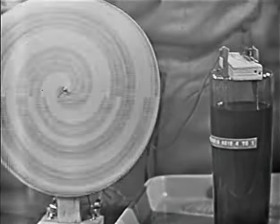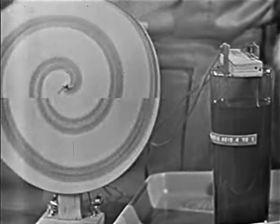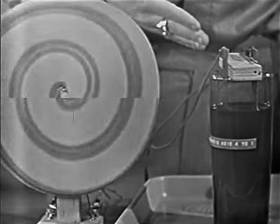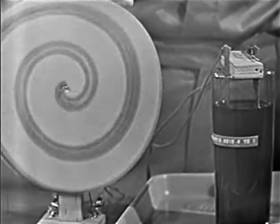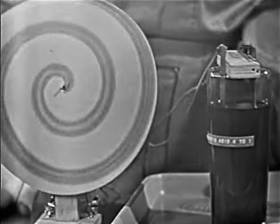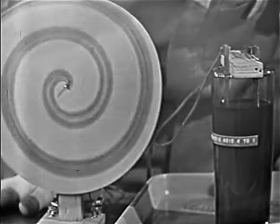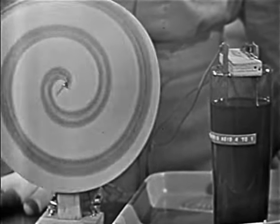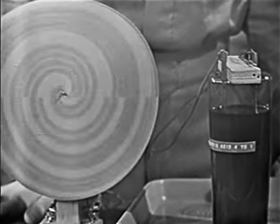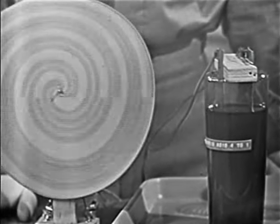Now, we made a battery. How were we able to make it? What was the secret of the ingredient? Well, we needed two different metals, an inactive and an active one. Right. And which did we use in this case? Copper. And zinc. Okay. But another important thing, we needed an acid down the bottom. Well, we needed a chemically active material. We didn't necessarily need an acid, as you'll see. In this case, we use sulfuric acid. And what was that purple powder? Potassium permanganate. Yeah, a depolarizer. This thing is going away. Yeah, so. Well, let's just let it run, see how long it goes.